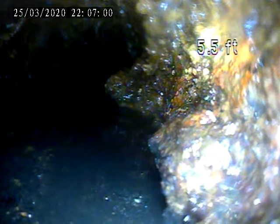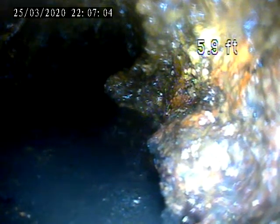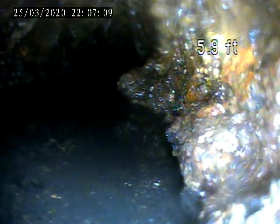That's going to catch waste. The bottom of this pipe is black like that — it means it's corroding and starting to rot away. It's called channel rot; it's constantly running through it.